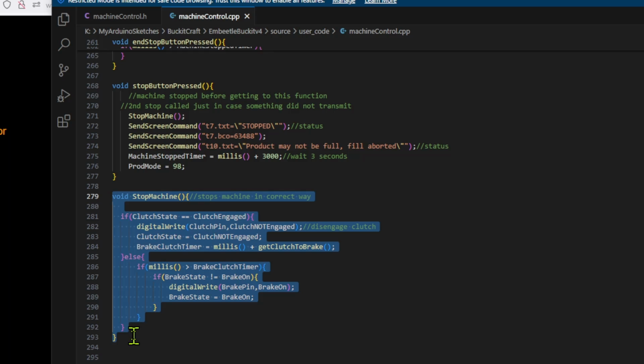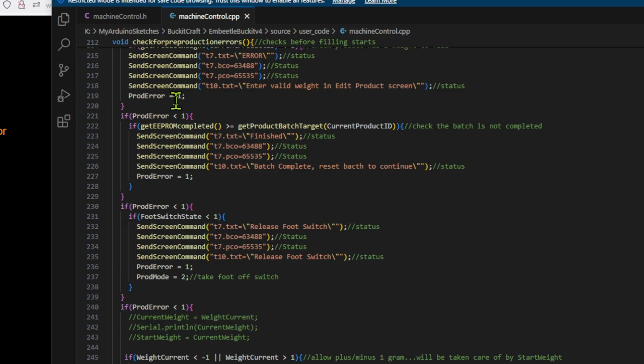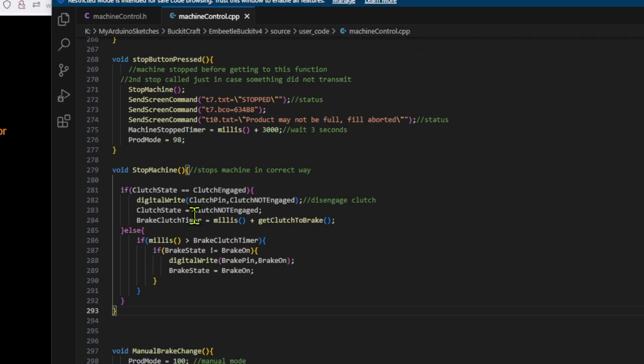And so as you're thinking about your code, especially things that can affect the safety of the machine, just think about, have you written your code not only so that it fails safe, as in it works, but is it written in such a way that if all of a sudden I edit something up here, is it suddenly going to destroy the order of items that affect critical items?